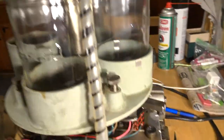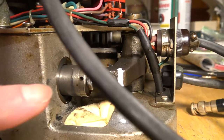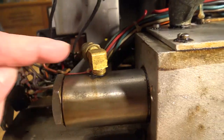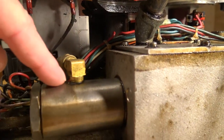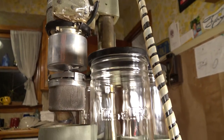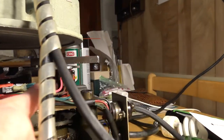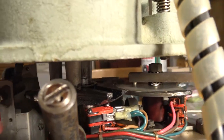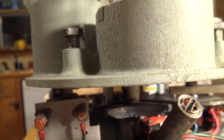Now that pump motor switch turns on the hydraulic pump. There's a piston here with a hard line running to the very center of the machine under the table. It pumps fluid into this line and raises the entire motor assembly all the way up to clear the jars. Then that big steel arm with a pin on it turns counterclockwise, sliding into notches under the table to rotate the whole table to the first jar — the cleaning solution.